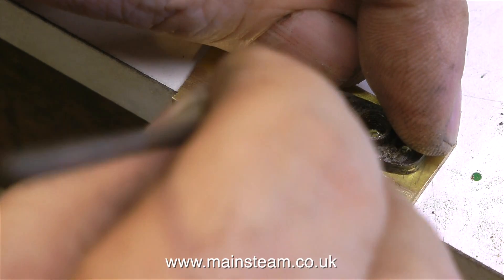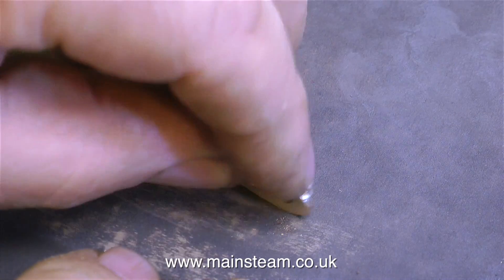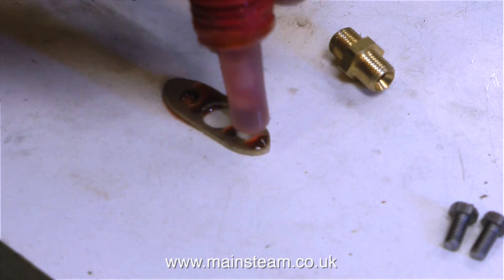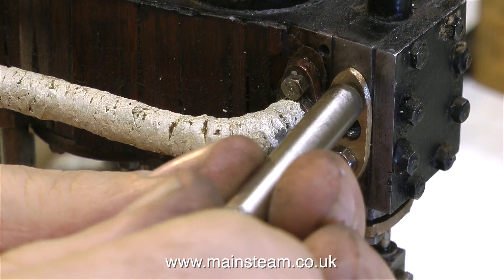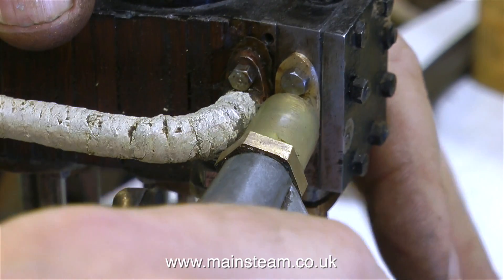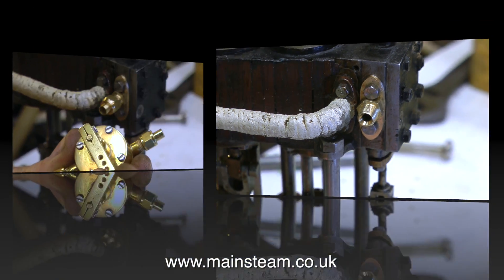In this clip I'm marking out the hole positions on a piece of brass. I corrected the position of the centre hole and drilled and reamed it a quarter of an inch — you'll see why in a minute. After shaping and cleaning this piece of brass, I gave it a coat of Loctite 542, so when it's held to the steam chest it's never going to leak. The centre part of the fitting is a commercial union, also put in with Loctite 542 — this is never going to leak, as you can see by the lack of leakage when I apply compressed air to it.